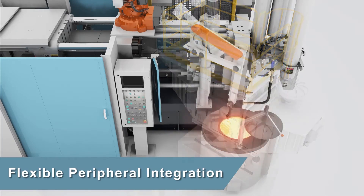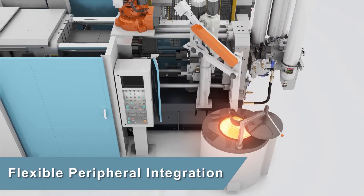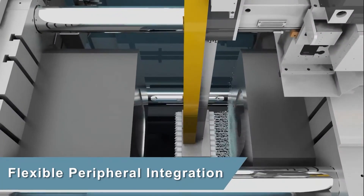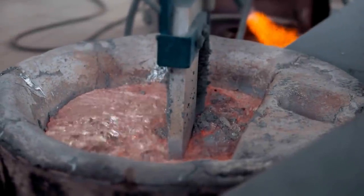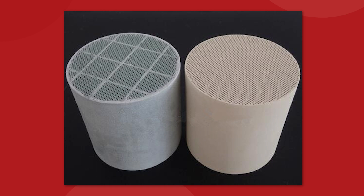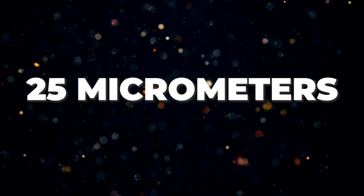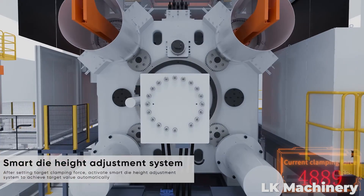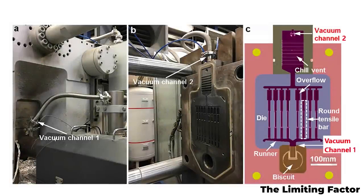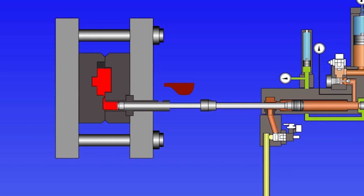The Gigapress is an all-in-one casting solution. It features a melting oven that will liquefy solid aluminum at 1,500 degrees Fahrenheit. Then the mixture is purified by removing the slag or aluminum oxide from the top. The molten aluminum is then treated with argon gas to further remove impurities and moved through a silicon carbide filter to eliminate any remaining particles larger than 25 micrometers. The die mold is prepared with a thin coating of soybean oil — just like greasing your baking pan — and then a vacuum is used to remove air from inside the mold. The metal is pumped in with a high-speed plunger like a syringe needle, and the casting is formed.